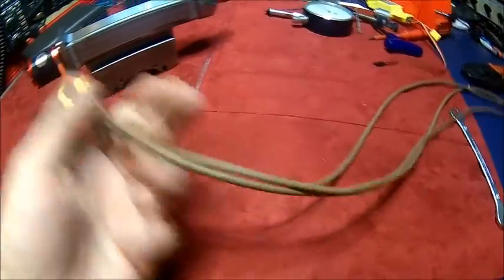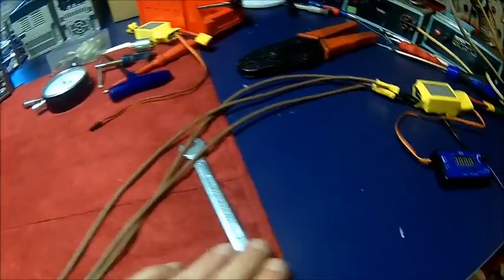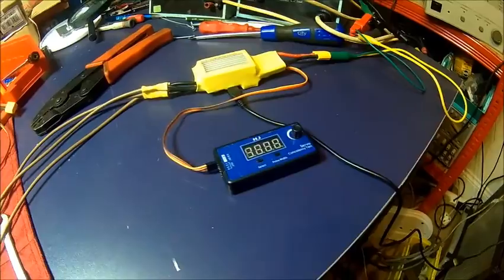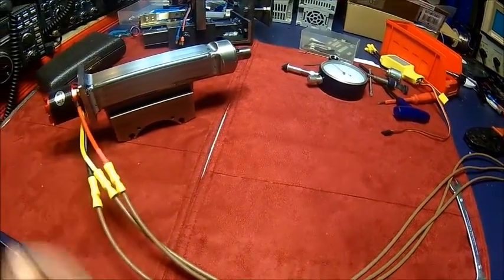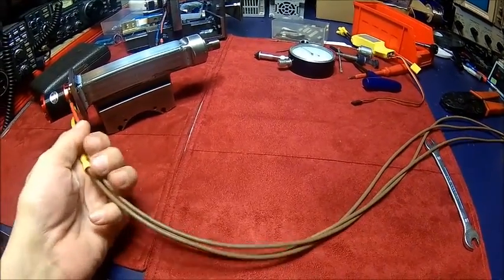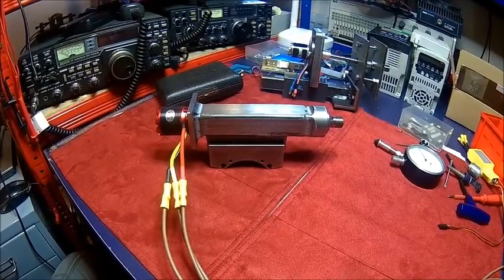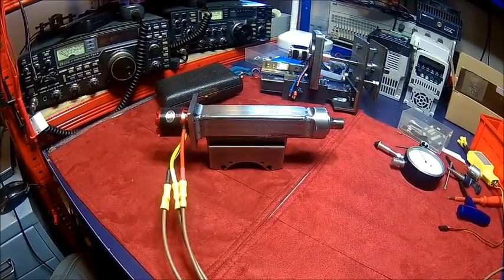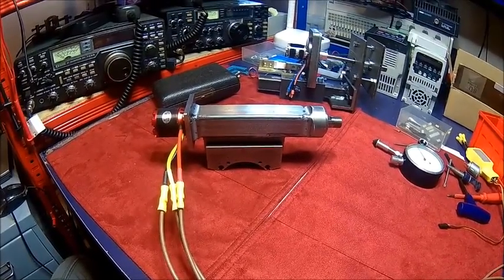If you wire these things up, use appropriate wire, because there might be 10–20 amps flowing into the ESC. Just make sure you're not cooking anything. Same with the connectors — if you use cheap ones, they get hot. I use just the standard bullet connectors, but they do get a little bit warm. That should be it for today. Thanks for watching, thanks for subscribing. Until next time!